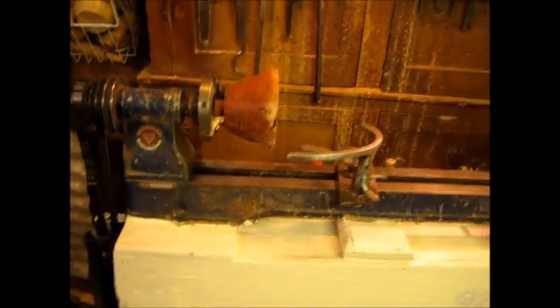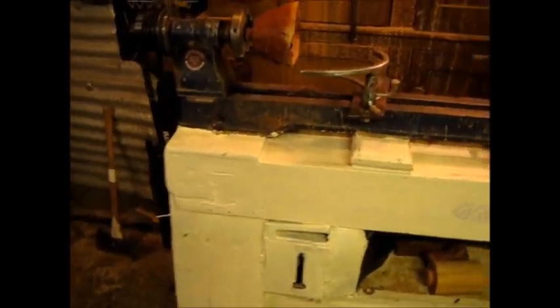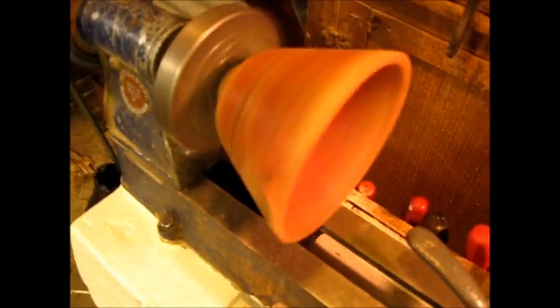That's how you convert your old-fashioned step pulley lathe to fully adjustable from 100 to 6700 RPM. With a different pulley configuration you could go faster, but I wouldn't recommend it. I spin manzanita, maple, ceanothus, and all kinds of hardwoods, so it's nice to creep along at two or three hundred RPM. Just reach down and hit the speed control. You can get it going as fast as you want for polishing or finish sanding. The only downside is there's no quick reverse — you'd need to install a switch to reverse the direction of the current.